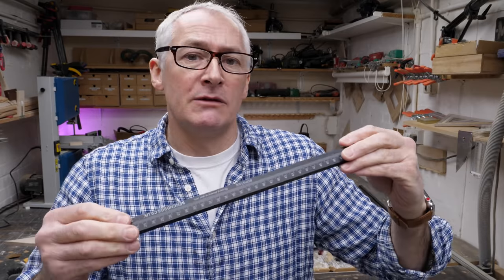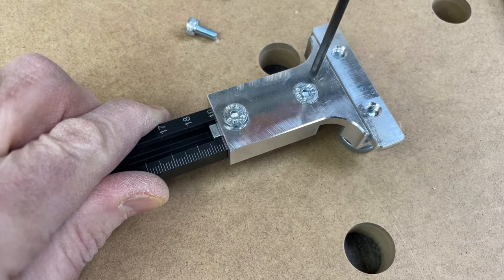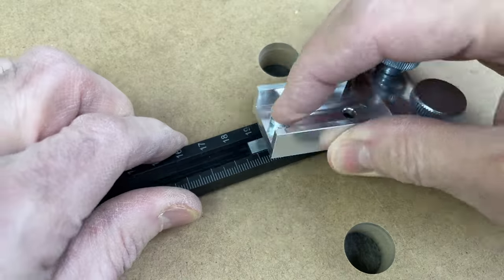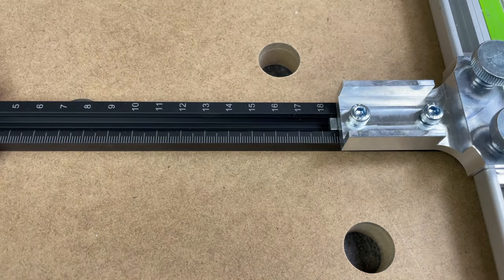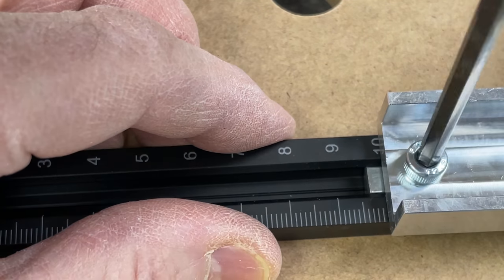So I mentioned earlier on that the 350mm bars that come with the long rail set have another trick up their sleeve. In fact, they all have a trick up their sleeve, because on the back of that extrusion there's another scale that allows for narrow cuts. You can whip off the extrusion and attach it to the underside of the track adapter with the alternative bolts that come in the kit. And with the truncated scale face up, whatever the scale reads against the end of the track adapter — well, that'll be the width of your cut.